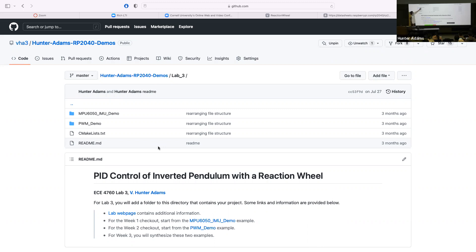The other demo here, which will be relevant to you for week one, is where you hook up the MPU 6050 IMU and accelerometer to the RP2040. This demo reads the sensor and plots the raw accelerometer and gyroscope measurements in an oscilloscope-style view on the VGA screen. This is a really nice starting point for getting your complementary filter working.